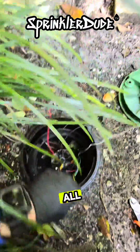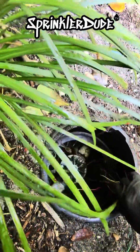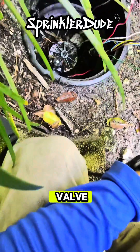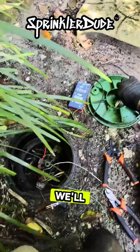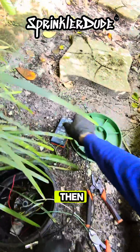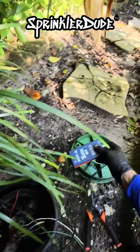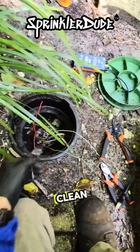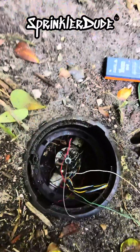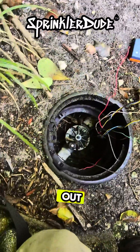Now we can clean up all the wires here. We're going to take our solenoid wires and test our solenoid at this location. Either this red wire or the green wire was supposed to be going to this valve — we'll find out soon enough. We'll go ahead and connect our station master to the two solenoid wires here and give it a test. Look at that — solenoid works great. Let's try not to get wet here. We'll clean up all of these wires so you guys can see in there and see where this leads us. I'm not sure which wire is going in which direction, but we'll find out soon enough.